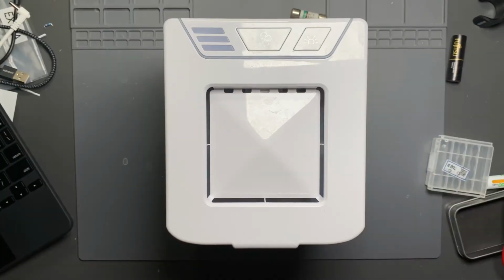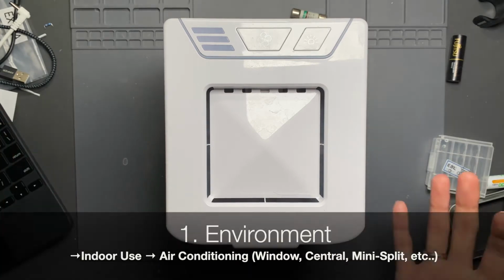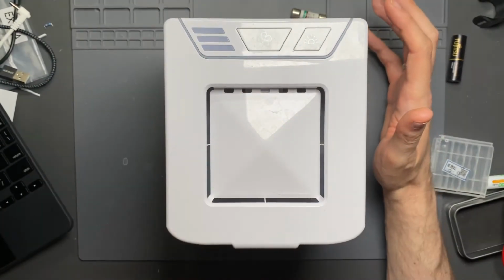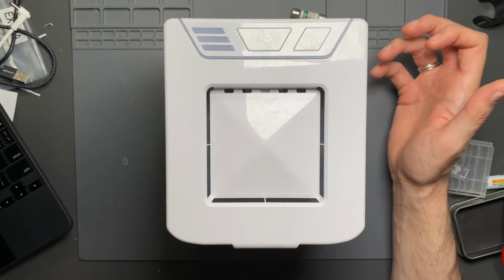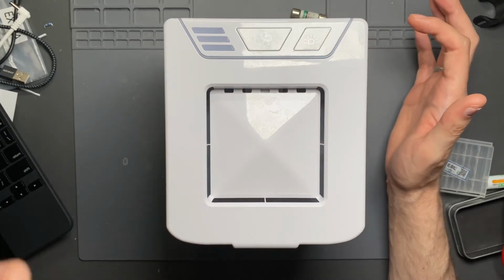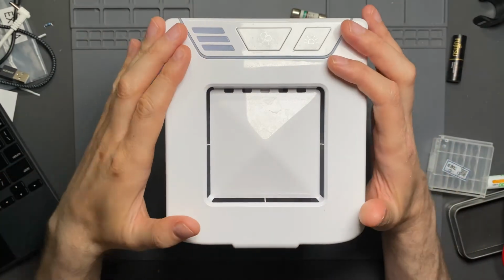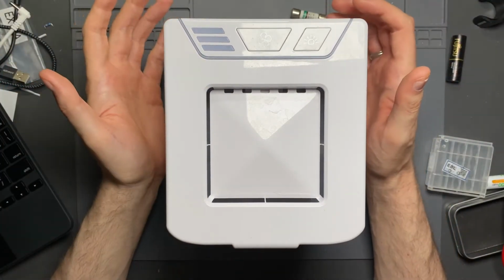If you're in a situation where you kind of have average relative humidity, that's somewhere between 40 and 60%, and you have moderate to high level temperatures, then this could still work very well for cooling an area of your home or the overall home, just to help reduce the runtime of the air conditioning, but it requires air conditioning. It really would help then control that humidity so that it doesn't go above 60%, especially if you're using more than one of these in a home with more square footage than, say, about 800 to 900 square feet.